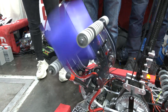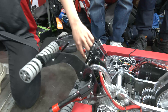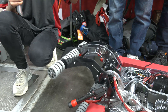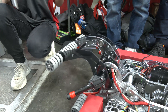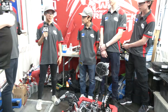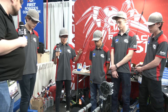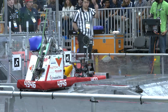Can we shoot it out? Yeah. So that's how it works. We have this limit switch here, which is spring-loaded. It makes sure that when the cube is intaked into the cube shooter, the intake doesn't vigorously spin as it does when it's trying to intake. It does a slow spin just so that the compression of the cube when it hits here doesn't cause it to bounce out. We found this was mainly an issue during our regionals — when our robot was moving with the cube shooter up, the cube would bounce up and down due to compression and shoot out because the wheels weren't spinning, so there wasn't enough friction to keep it in.